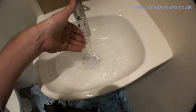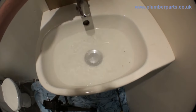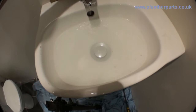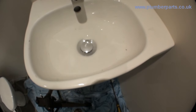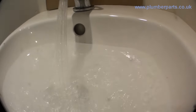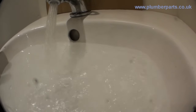Let's wrap around and check — nice and hot, and cold. Testing the pop-up waste now. We shut the plug and test the overflow — it's going up over that overflow, which means we're testing the overflow connection we did a few videos ago.